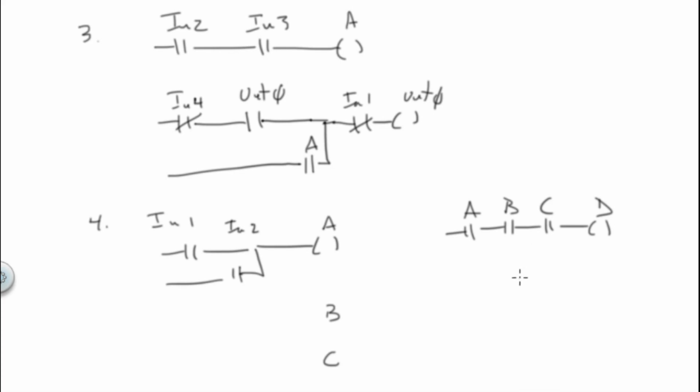Then D and N7, or excuse me, I'm going to go back. I'm going to do this the other way. You've got to flip this logic around. It's N7, and then OR output 1 and D give me output 1. So it's kind of complicated, but that's how you did those in that era. So it gives you a little bit of practice with writing logic, but having to turn it around and write it a little differently.